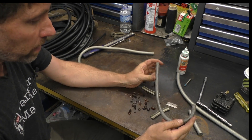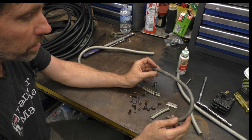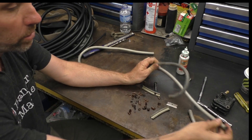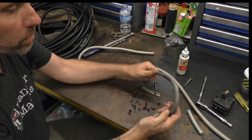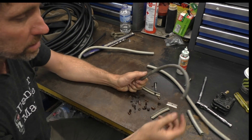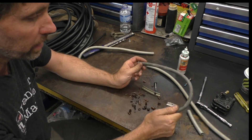I also find this grey fuel line tends to become very brittle. This section was outside the transom, this one was under it and is still reasonably flexible, so it's mostly been affected internally by the fuel. But this grey fuel line is very hard to bend once it's been out in the sun — it's not particularly UV resistant, so that's another reason I'd avoid this type of fuel line.